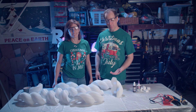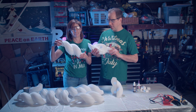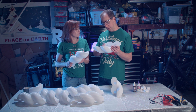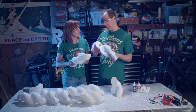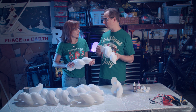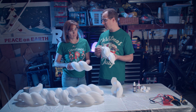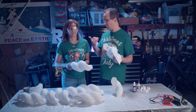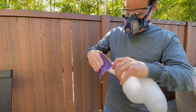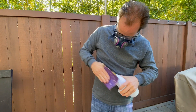After many hours of 3D printing, we have all of our pieces. Each of these pieces we need to put back together. We're going to glue them and hide the seam. First we're going to sand these so we rough them up a little bit so that the glue is going to hold better. We sanded each section to ensure a nice tight fit when we go to glue them back together, and also lightly sanded the fronts to remove any irregular areas.